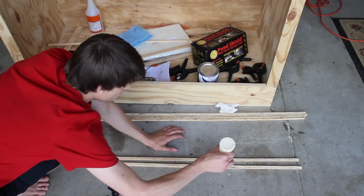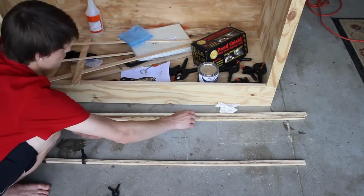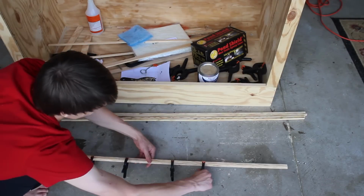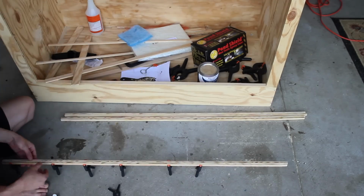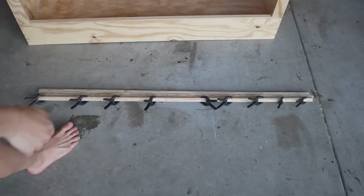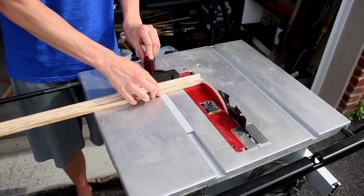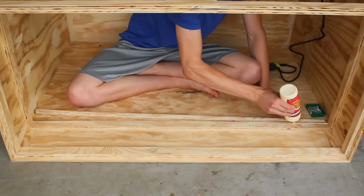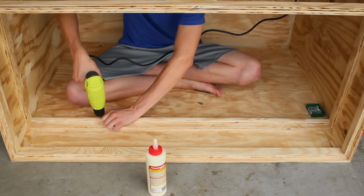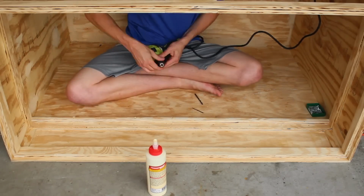Then I cut several strips of plywood to 1/2 inch wide. These boards were glued together to create several boards that were 3/4 of an inch thick, in other words, the thickness of 2 pieces of plywood. After drying, the new boards were cut to the proper length and attached to the inside of the bottom of the light compartment using wood glue and screws. The main purpose of these boards was to create a lip to attach a screen later on.